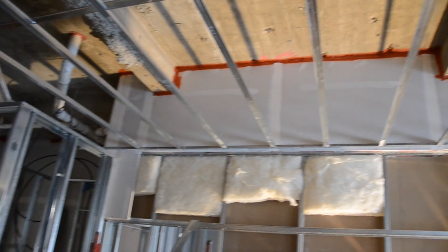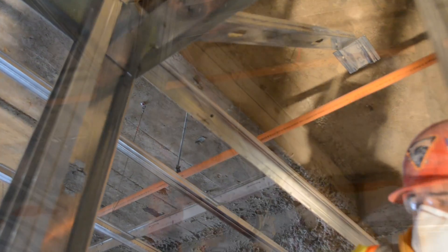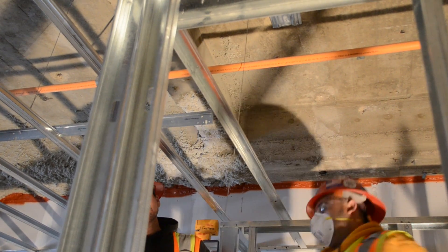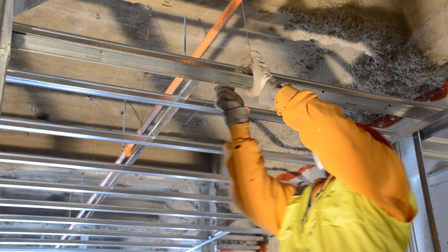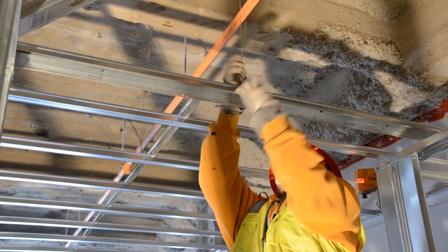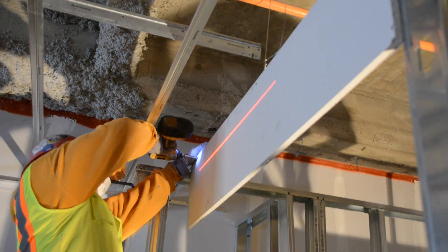At the entry hallway, we have to drop our ceiling 12 inches. No need for time and material wasting stud drops — just transition off your short span. At the transition point, just screw attach CAM utility angle to the length of short span and run wires to structure.